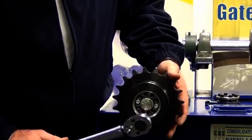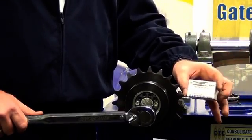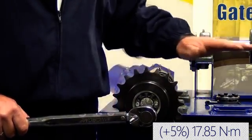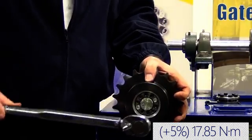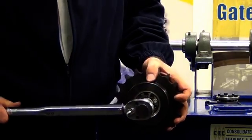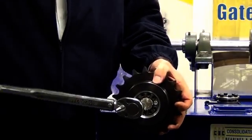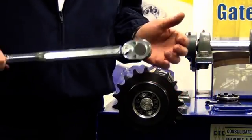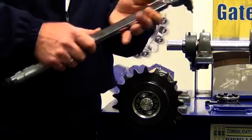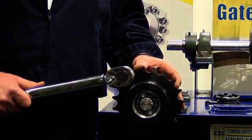Now that we've got these tightened up hand tight, we again take our torque wrench and start to torque these up. The torque level is available from the front of the box — in this case, 17 Nm again. We set the torque wrench to 5% over and above the 17, and go around ensuring they are all up to the recommended torque value, going from 12 to 6 to 3 to 9, ensuring they're all done up nice and evenly. Once achieved, we set the torque wrench back down to the 17 — 5% below what we've just done — and repeat that procedure, going 12, 6, 3, 9, making sure it's all done evenly and tightly.